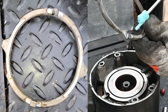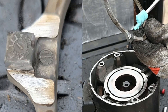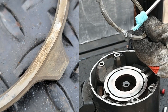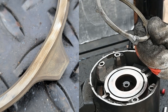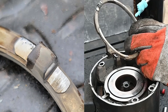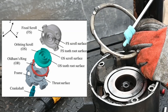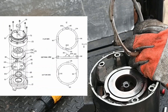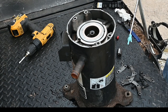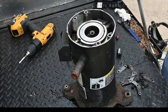This is our oldham coupling and we do see signs of wear here in the sides. That refrigerant oil should be attached to this at all times, so again that's a sign of refrigerant flood back — it washed the oil away from these parts and allowed it to rub. But this is aluminum, probably the weakest part of the whole thing, and it's made to break before the other scroll pieces do. Even though it has some wear on it, it's actually not bad — a little bit less wear than I've seen on newer ones, but for 31 years old running summer and winter, that's pretty good. Curiosity says what does it look like inside, so we're going to make some more cuts and take this all the way open.